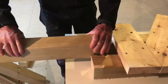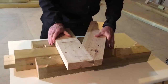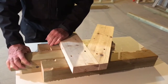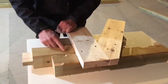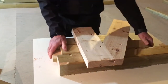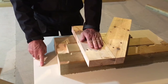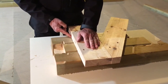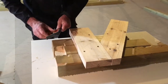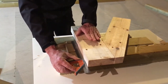The second thing is get your material and you need two off-cuts of that material at the same height — they've got to be flush. Then calculate the width of your material and you need those two off-cuts to be parallel on the table so that the timber slides in between. Leave a slight gap so you're not knocking it with a hammer and forcing it through. Once you've screwed them onto your flat board, get a nice straight piece of planed timber to use as your straight edge. Get your combination square and make sure that timber is exactly square — you can be as fussy as you want because it really matters.